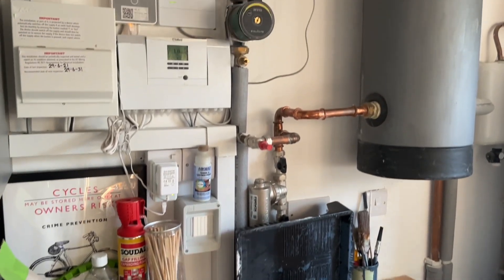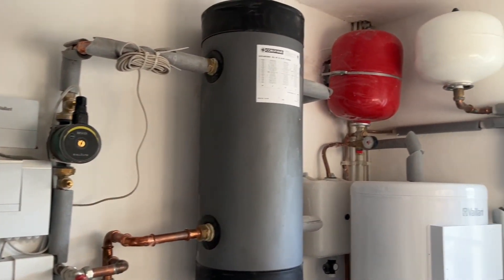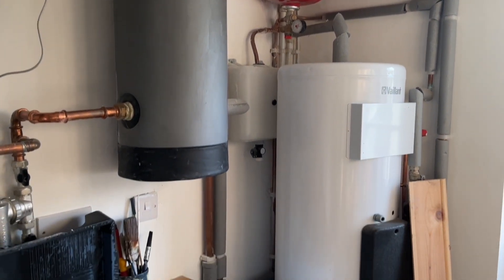Inside, we'll need to take up some space for a few things that help facilitate heating with a heat pump. On the heating side, this includes an expansion or pressurisation vessel and a buffer vessel. On the hot water side, this includes a hot water tank and another expansion vessel. All this does take up some space — we have it all in our utility room. Some manufacturers offer this as a packaged unit, and some installations don't need a buffer vessel at all.